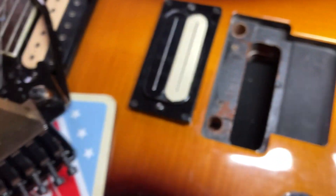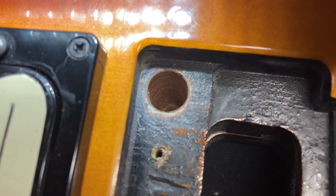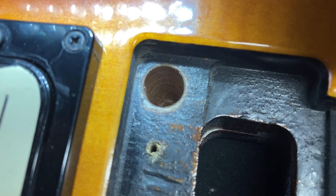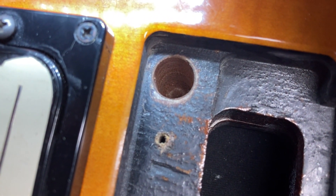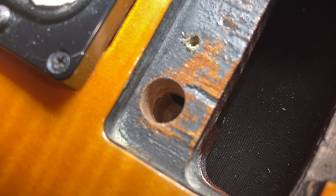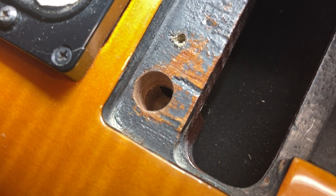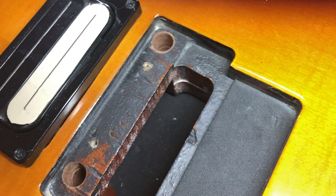I'll get a torch on it — you might just be able to see there's a line. About halfway down you can see there's a circular line where it's cutting away the wood. It's just grinding it away as opposed to cutting it. I'm going to go the whole way down like that. On the other side you can see a much more pronounced line where running the drill bit down is grinding that away, taking it out to something like 9.95mm.